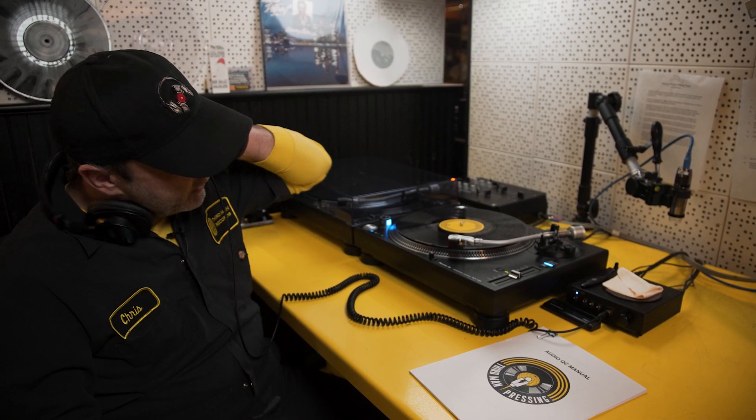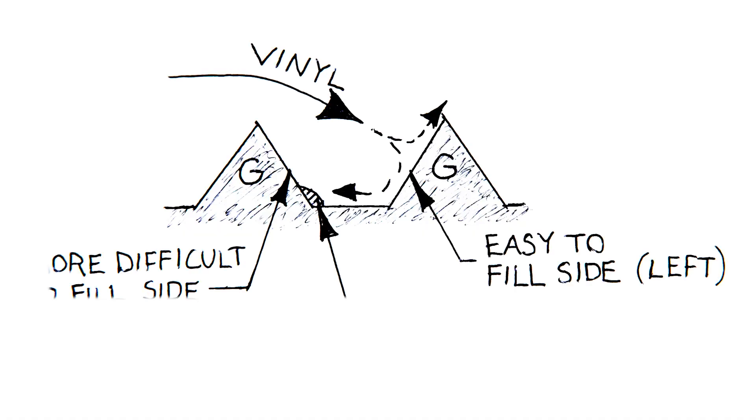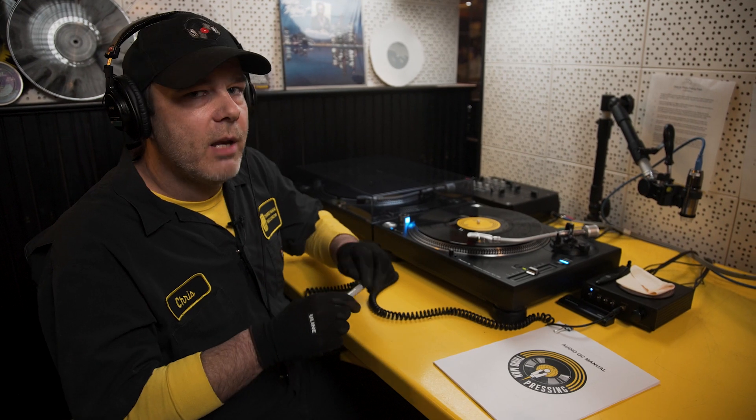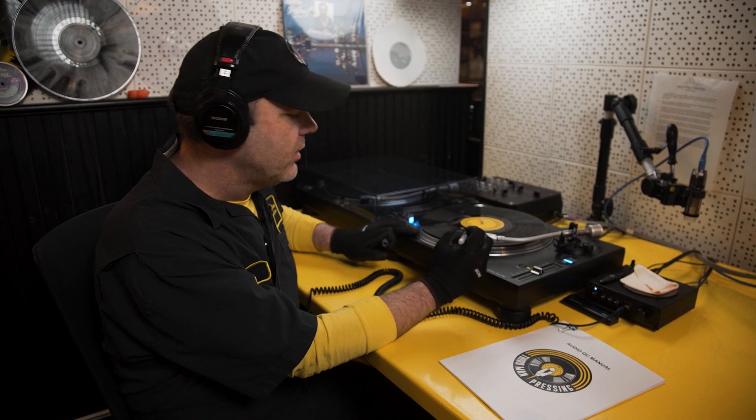There is a little bit of non-fill. Non-fill is usually not visible with the naked eye. It can be found under the microscope, but you need to put some Sharpie alongside it so that you can find it when you get to the microscope. This one already has some Sharpie on it because I previously did this, but I will go over this just to illustrate.